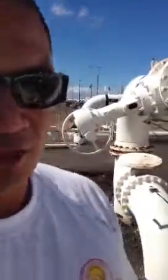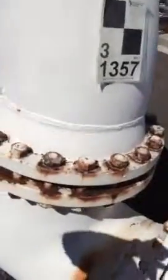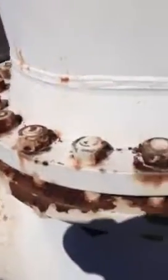Royal here from Kili Painting and Coating — this is day two of ASIG jet fuel yard. We're currently prepping certain areas for rust grip and supertherm. As you can see, we got a lot of corrosion on the bolts and in between. We're just taking off all the flaking rust, getting it to where it's pretty much solid metal and material.